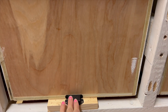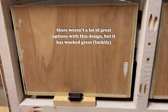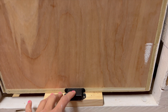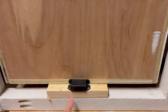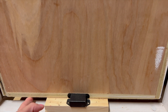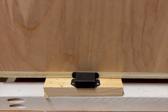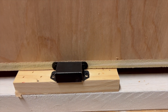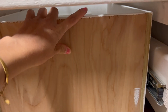After installing all the handles, we installed the latches in a jerry-rigged way. We used the same magnetic latches as our upper cabinets — they work really well. We had to add a piece of three-quarter-inch wood because the drawer sits slightly above three-quarters of an inch, so the magnet needed to be level with the drawer. We got that nailed into the structure of the couch and the magnetic latches all latched in. Now it's pretty sturdy.